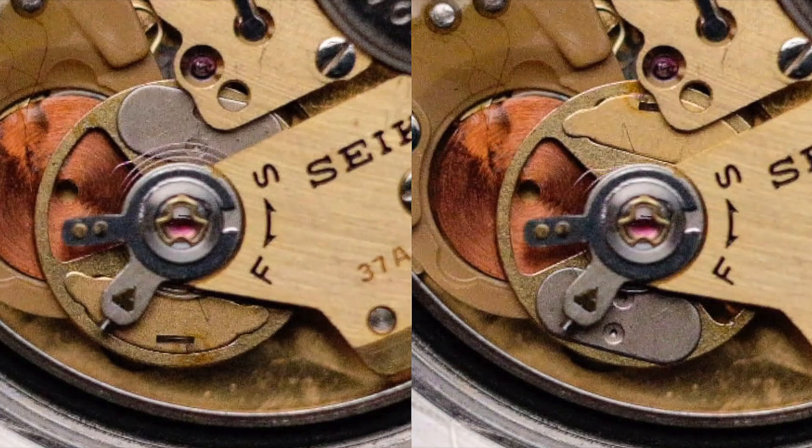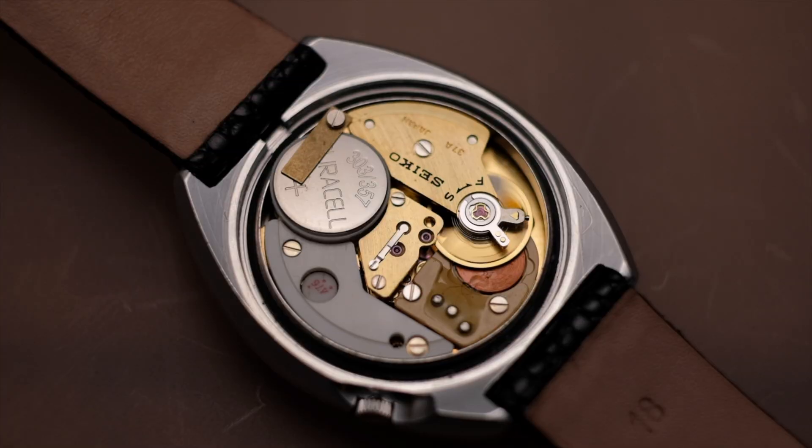The notional difference between those two positions is about 180 degrees, but we must remember that the balance itself will have undergone a full rotation in between reaching those two limits. So we have an approximate measure of about 180 degrees between the two turning points, which we have to add to the full 360 degree rotation — giving us 360 plus 180 divided by 2 — which gives us an amplitude of about 270 degrees, a full 100 degrees larger than the amplitude indicated on the time grapher.